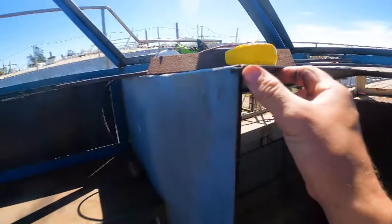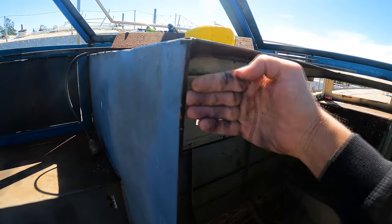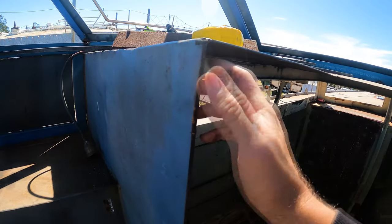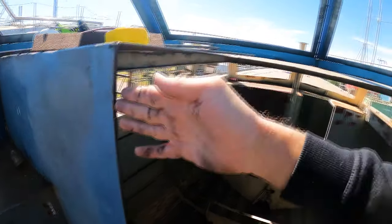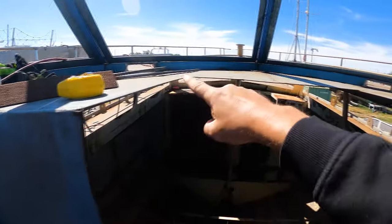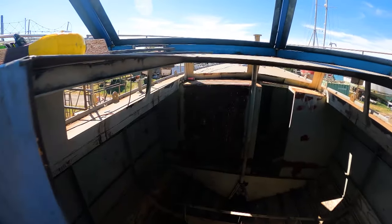And then on the inner sides here, I'm going to weld in a 10 mil by 50 mil bar, going down. It's going to be that thick and strong because I want nice sturdy brackets to go on the doors. I don't want loose and saggy doors after a couple of years. So the doors are going to come in here and swing. Today we're going to start by welding in that square bar and starting to build the little bracket that's going to hang down the bottom.